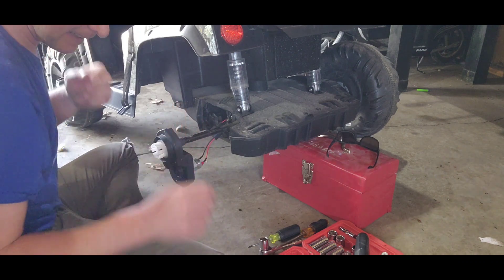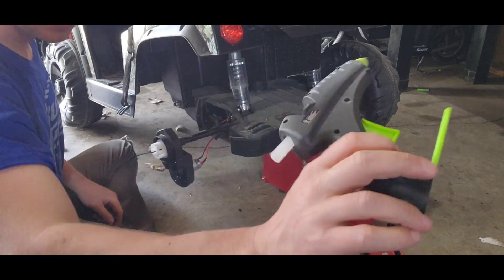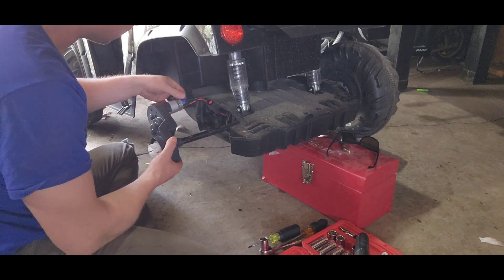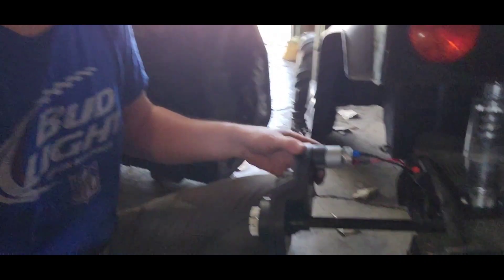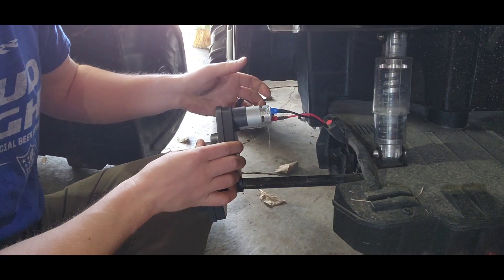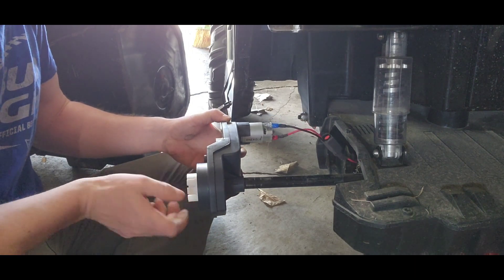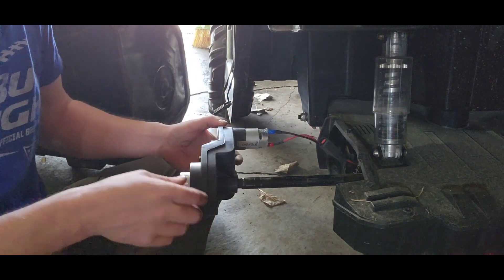So I ended up — small electronics' best friend — I put some hot glue on it because I do want to be able to take this apart later. These wires are just hot glued on — they're stuck in there with the pin and then hot glued. If I need to, I can yank them off. What I'll most likely end up doing if I replace this is just take these two screws out, take the motor out, take this off, replace the gears — whatever gears are broken. We'll get to that in the next part of the video. I'll go ahead and slap this together, maybe do a little time lapse to show you.